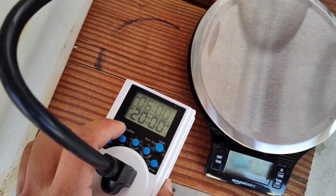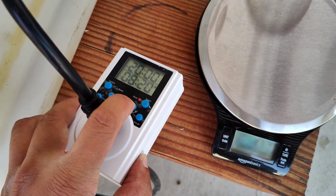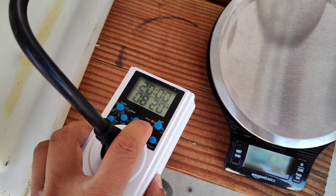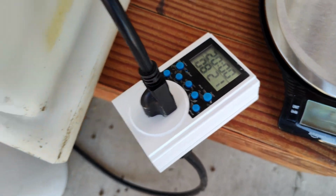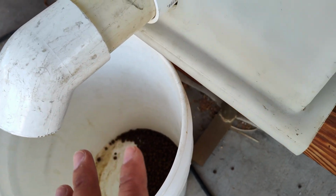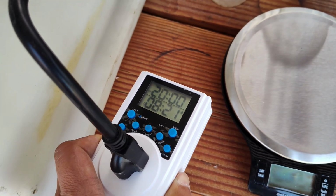Okay, so we're gonna have to confirm the first setting. Confirm. Now it's gonna keep spinning, right? Because the work light is on. Now we have to hold this button to combine this minute and second setting. Here we go. We're gonna hold it. Okay, so now the ringer bell is flashing. That means it's combining the other one. So what you're gonna see is, see that? It turned off. It spun for 7 seconds and then it turned off. And it's not gonna turn on again until that timer countdown, which is 59 minutes. Once that 59 minute elapses, it's gonna spin again.